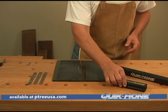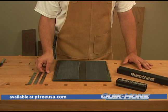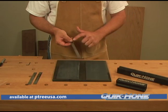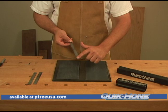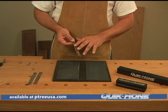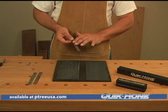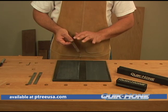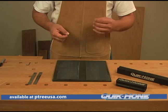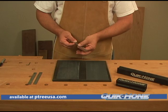The first step to sharpen your jointer or planer knives is to remove them from your jointer and flatten out the backside, making sure you have a nice flat surface. I have no major nicks in my knife so I'm going to work with a 220 grit all the way through a 600 grit. Never sharpen beyond 600 grit on a jointer or planer knife because you create too sharp of an edge that's too brittle for the application.